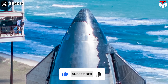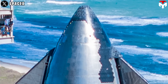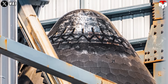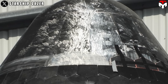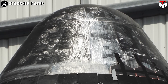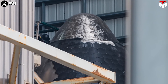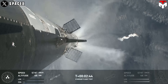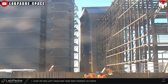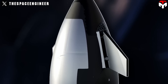What is clear is that these heat shield tiles will be held by adhesive rather than pins. This shift has been kicked off on Ship 29 by removing the old tiles, cleaning the area, and roughing the surface to allow the adhesive to stick to the metal better, keeping the tiles on the vehicle. SpaceX is doing its best to ensure the heat tiles will not fall off again as they did in Flight 4. If that works, the new update will be applied to Starship's next generation.